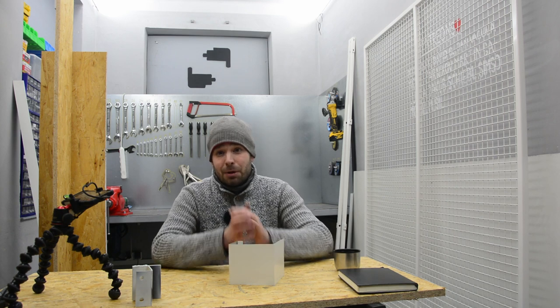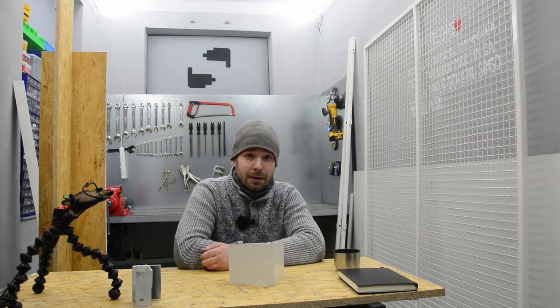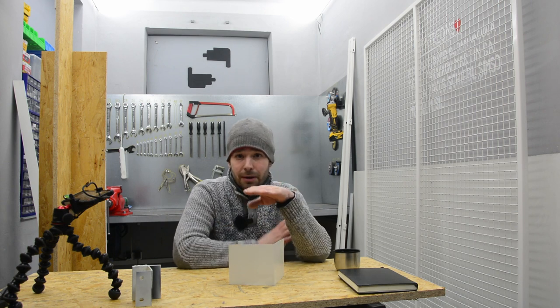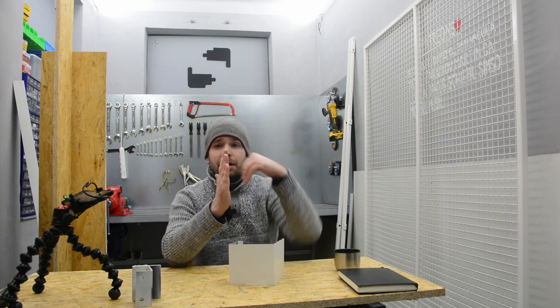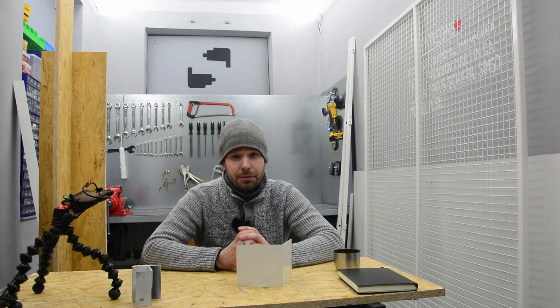The problem is that I'm using black metal, the square profiles and the L profiles, which are the lowest quality of metal you can find. It's quite cheap, but you can find pieces which are very straight, and you can find pieces which are just wobbling around. That was the problem, and I ran into an issue where the bending section was bent downwards, which is a problem, because when you turn it, it's not touching the metal properly, and the bending radius might change. So that was quite a big issue, and I tried to sort this out by introducing heat.